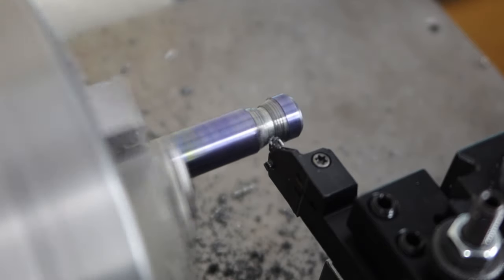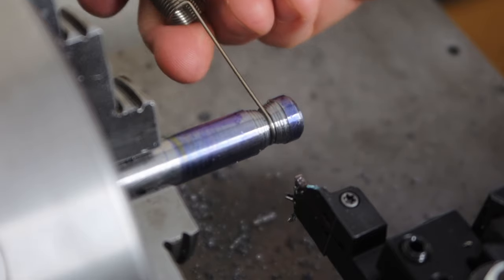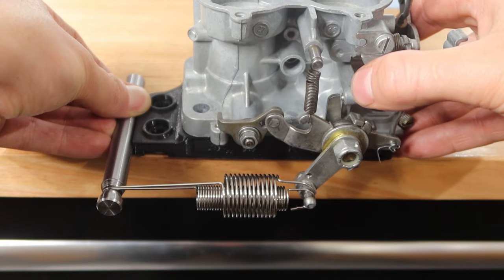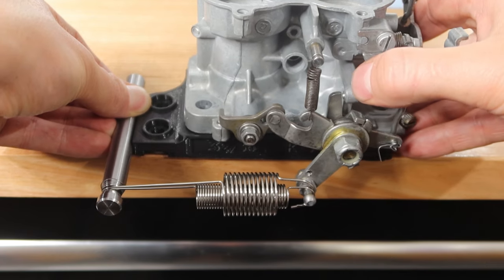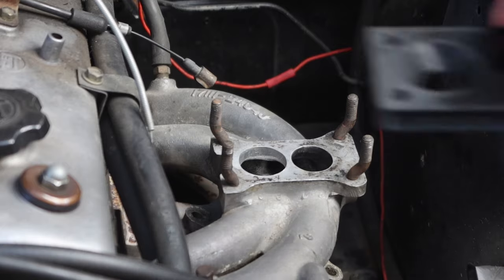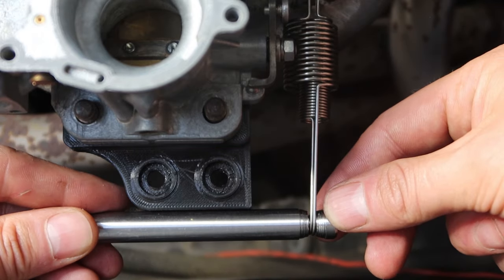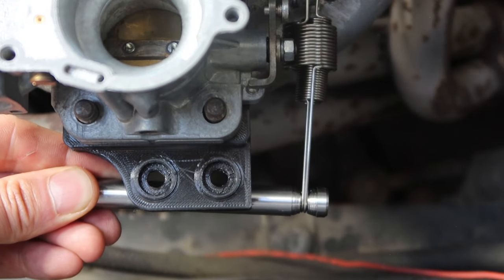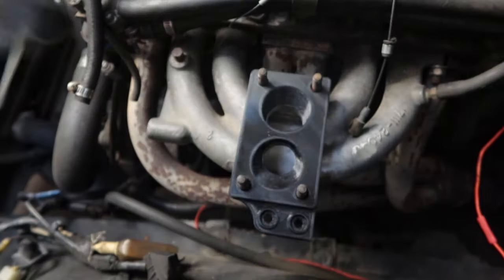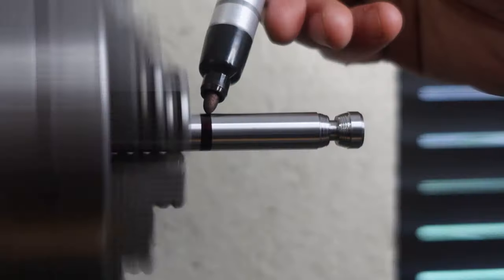Let's add a groove for the spring to attach to. Not too bad, but I shouldn't be lazy - let's check it on the actual adapter plate. Not bad, but I need a little bit more depth for those springs. And in the spirit of being even less lazy, let's check it on the actual car. That's looking pretty good. You can see what I mean about not wanting it too far in or out. As I expected, I'm going to have to shorten the length of the springs, but I've already planned for that. Back to the lathe, and I'll concede and use a sharpie for the rest of the marking out.